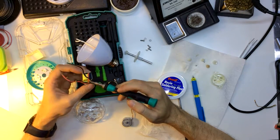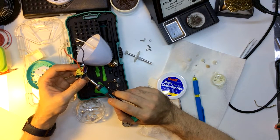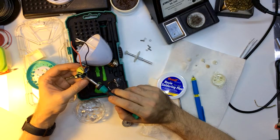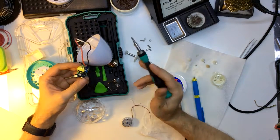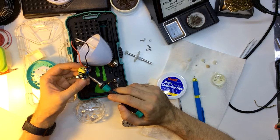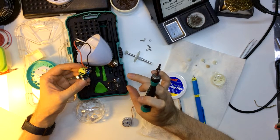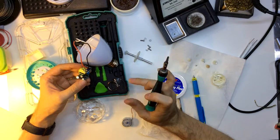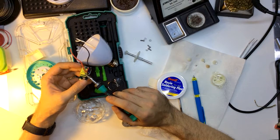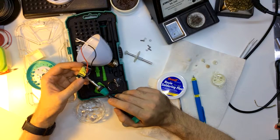And then whatever's happening on this side, I'm very confused about this, because it looks like all of the rectification is happening on this side, and then we've got direct current going into the transformer, and you don't put direct current into the transformer. So I'm imagining that this chip is probably turning, allowing flow to pulse into the transformer and causing a pulsing electrical field, which would then be able to send current into the secondary windings.